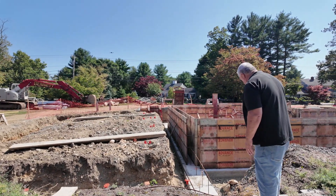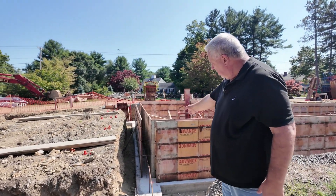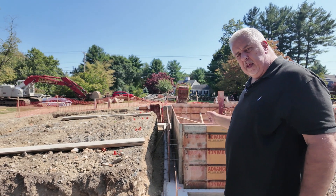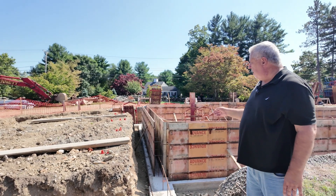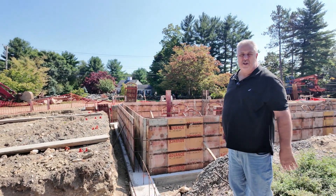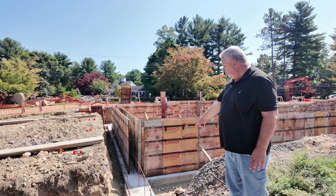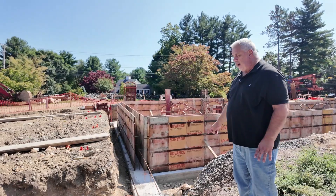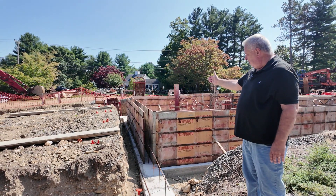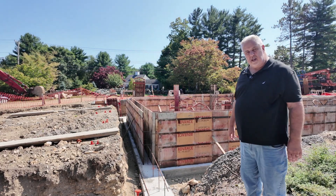You can get a good shot here and see how all of the horizontal bars and the J-bars and everything are tying in. Typically our foundation walls here are a 10-inch concrete wall. They sit on a two-foot wide by 12-inch tall footing. The footing has a couple of number-five bars in the bottom, and then it has the number-four L-bars that rise up out of it, so that we make the connection on that cold joint from cast wall to cast footing.